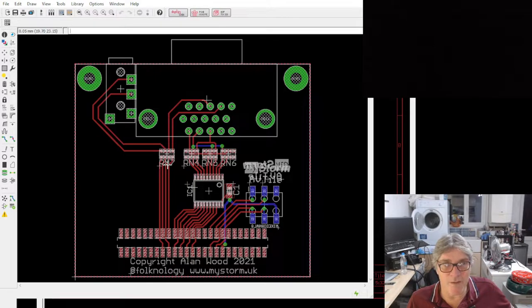Anyhow, so what we have on the audio video tile is analog VGA output, from a resistor ladder DAC driven by HCT or low voltage HCT driver, and an audio connector for stereo output. So we've got some analog audio out as well. So it's kind of analog video and audio, basically. That's what this does. It's a few extra signals, and those go up to pads on the top, and you could solder on a 3-pin dual row 0.1 inch surface mount connector if you want to get access to those.